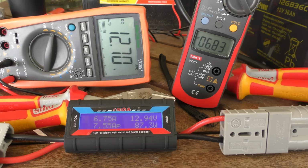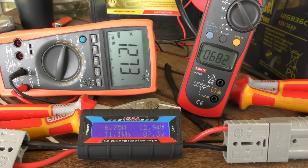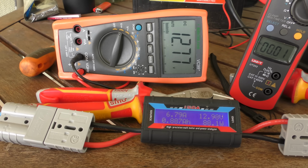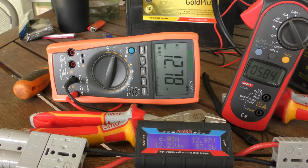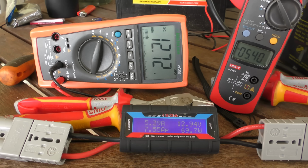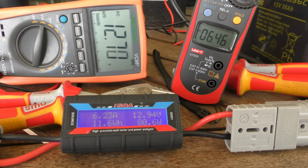And another fella gave me the math: watts divided by volts works for appliances such as fans, but watts divided by volts on the overall, like if you say, well, that's a 120 watt panel, that should give you however many amps, the math doesn't work like that on solar panels. You should know better. But you do now. Here we go again.